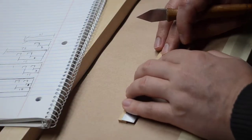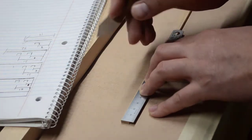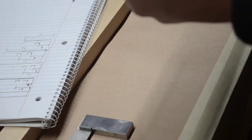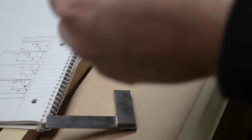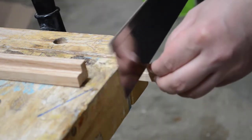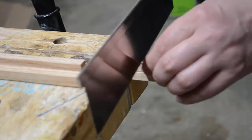Since I had a number of repetitive notch cuts to make, my first inclination was to mock up a quick jig, only to determine, after making a few cuts, my jig was out of square, which made a lot of crooked cuts. And the parts didn't interlock perfectly square, as they should have. Luckily, I caught this early enough, and decided to go for the cautious route, and swapped over to hand-cut notches. This means I need to now mark up my pieces, as I can't rely on the table saw to handle the placement for me. A fine-tooth pull saw makes quick work of the sidewall cuts for each of the notched sections. I start each cut using the tip of my finger on the saw's smooth surface to start the cut exactly where I want it.